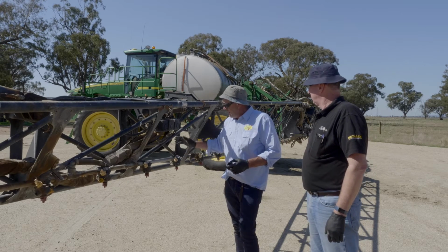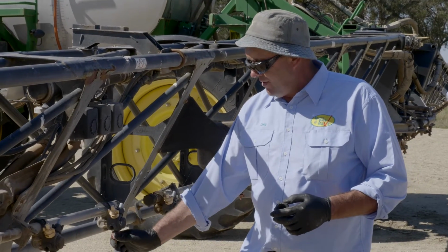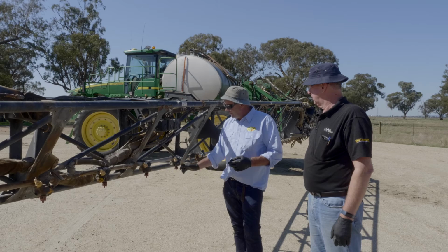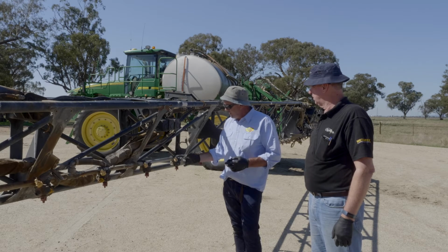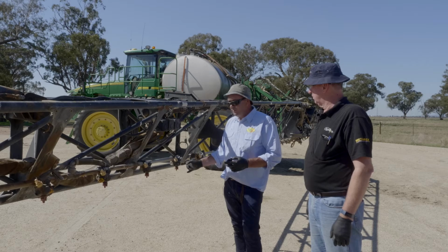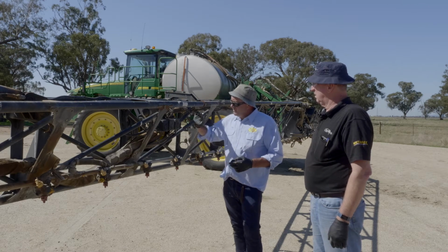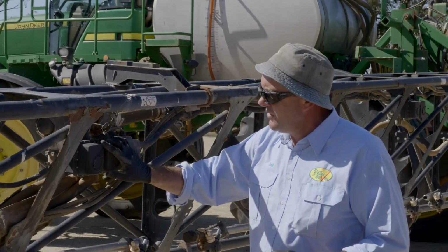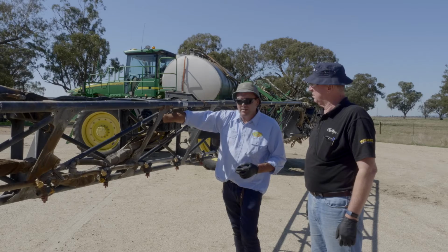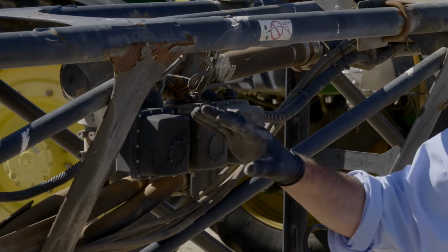When we do a full decontamination, we've got the material going through the spray. We'll decontaminate the nozzle we were using, but with this All Clear's detergents and that in it, now at that stage, while still got cleaning agent, we need to rotate all those nozzle bodies. Coming out along the boom, we've got our valve sections out here for the different sections. We've got 3 sections here in this bank. And there is another dead end area there, so lots of flush water going through. This is really critical to get that.